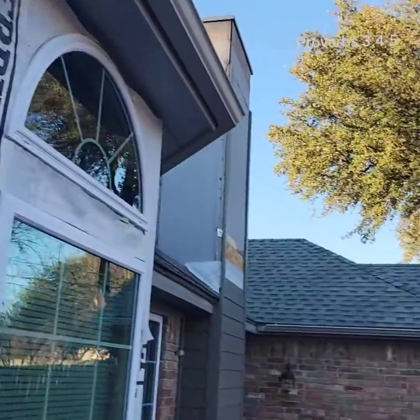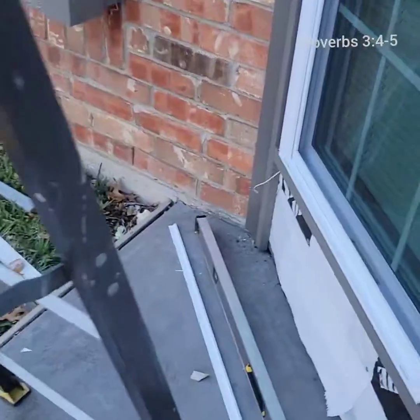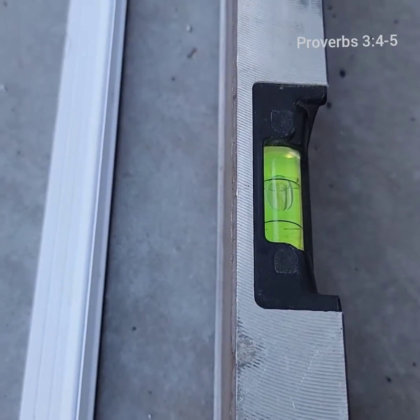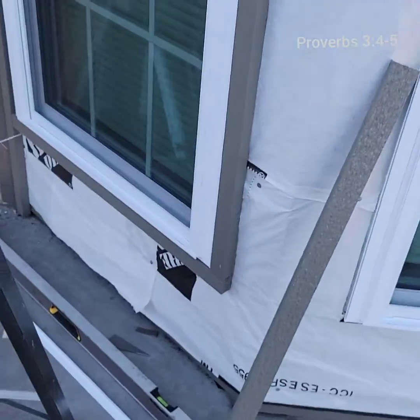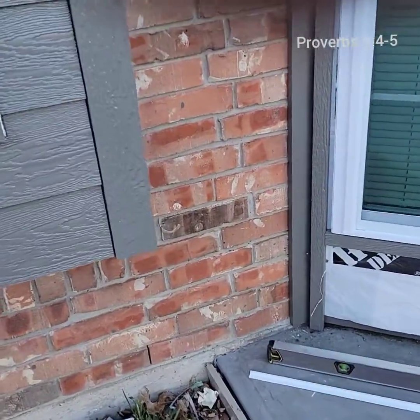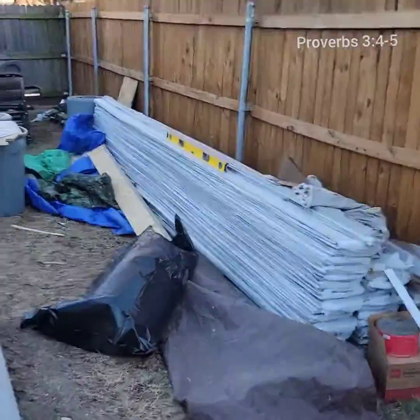Down here he just had this slab poured. The slab is supposed to be sloping away from the house, but as you can see by the bubble, it's kind of sloping the wrong direction — sloping back to the middle. It's supposed to be sloping that away. So I've got to run my trim boards pretty close to the concrete, really closer than the specs say. You're supposed to keep it two inches off, but I just can't stay two inches off or it's going to look terrible.